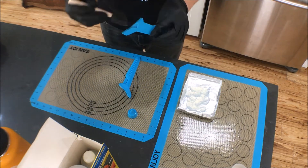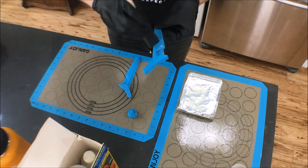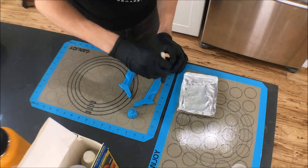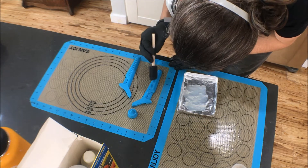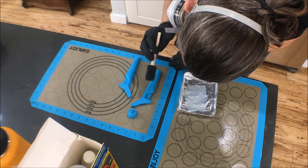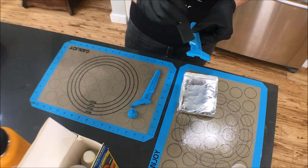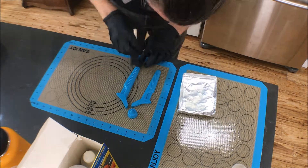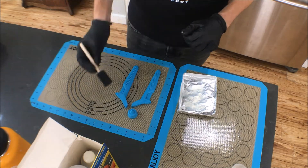When I'm doing XTC or resin casting or anything, I use these silicone mats — they're silicone cooking mats. They're great because if you get anything that drips on them, you can actually just put your things directly down on them like I'm doing here. And the XTC, once it cures, will just pop right off. So you don't have to worry about your parts sticking or anything like that — just a nice even coat on everything. Then you just wait for it to cure; it takes about 24 hours for a full cure.